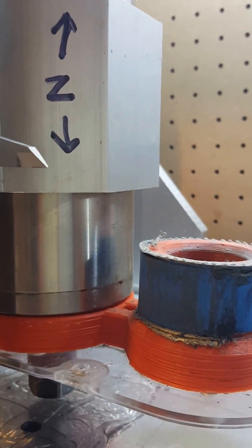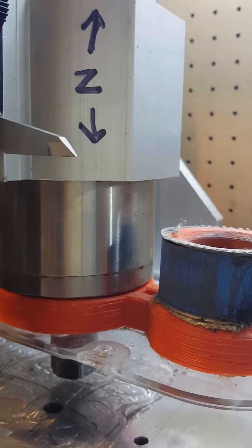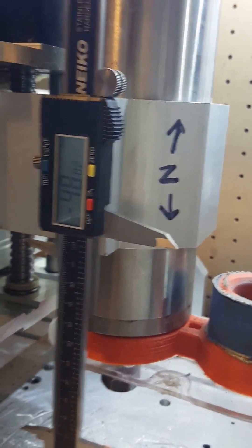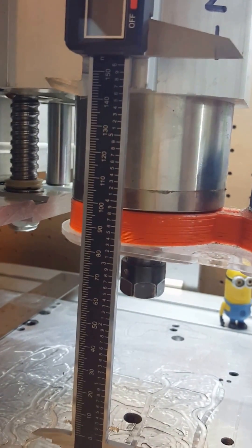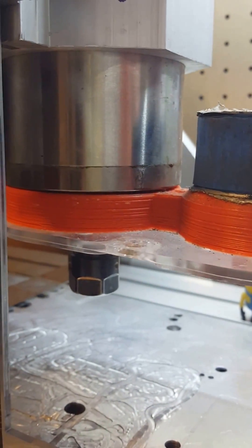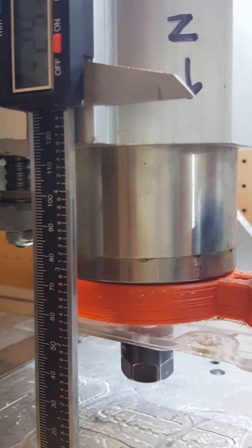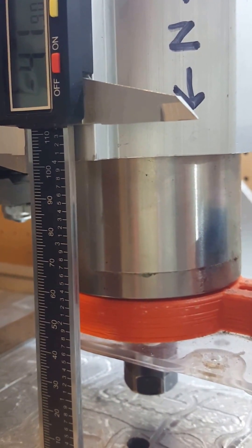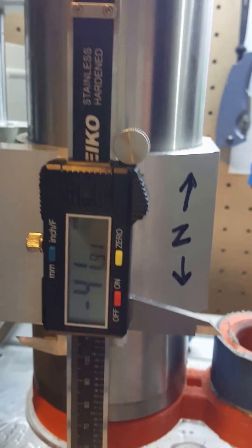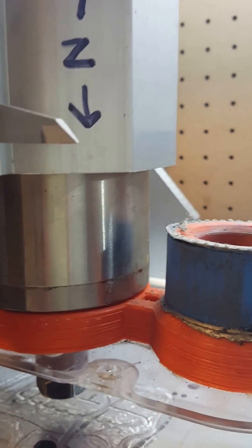So I'm gonna go back up. I can't really touch the bottom there, so I'm gonna just double check everything — set that back to zero. And then check and see where my spindle is about to hit bottom, and also make sure not only is the spindle not gonna hit, but make sure you don't hit right here either. So it's at 41.9, so I'll just do 38 when I do my calibration.